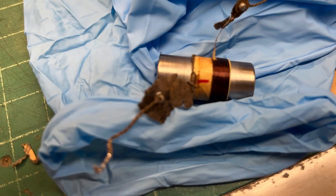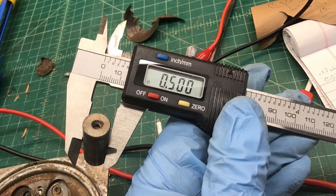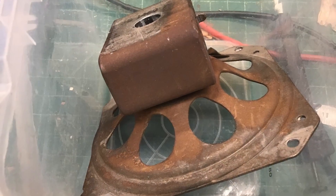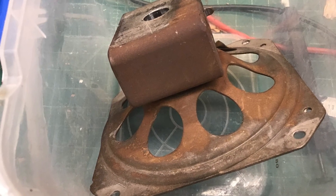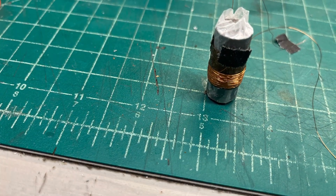I'm going to look at the open voice coil, and I'll need to reproduce it. I'll de-rust the speaker basket with citric acid and water, and make a new paper former for the voice coil.